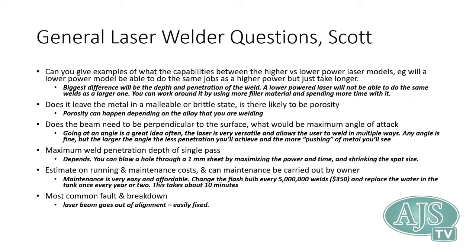Comparing 60, 100, and 140 joule laser welders — we also recently launched the Datto welder, which is about a 10 joule system with considerably less power. That one may be the exception on some applications. All laser welders are capable of jewelry repair type welds; you just need to learn the machine you have and maximize it for its capabilities. The Datto is a different design but still capable of many jobs.